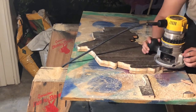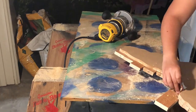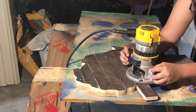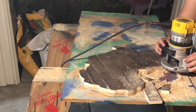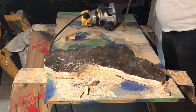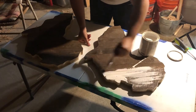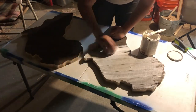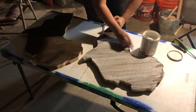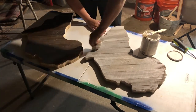Once the two silhouettes were all ready to go, I used the quarter-inch pattern bit again just to flush up the top of the board to the backer board of the Africa silhouette. This took a little bit of time but I just went slow and it turned out really great. I added an antiquing stain to give it a little more depth to the whole piece, let it dry, and then lightly sanded some of it off so that it wouldn't be overpowering to the brown stain underneath.